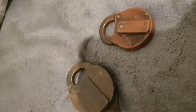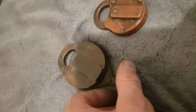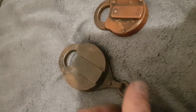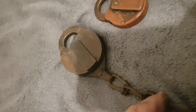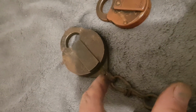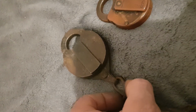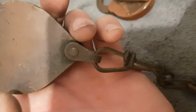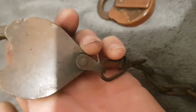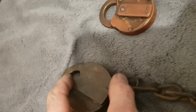I guess there are probably people out there that have a professional grading system, but I think a lot of it's somewhat obvious. You want to look at the chain, making sure that this has not been changed, and usually the first link would be your first clue. And you want to look at the rivet on there to make sure that hasn't been recently replaced or stamped. It's going to look as rusted as the rest of the clevis.